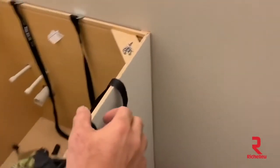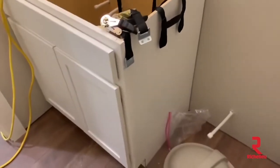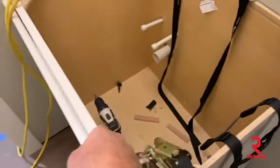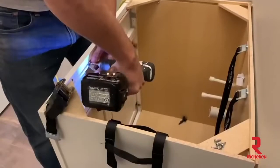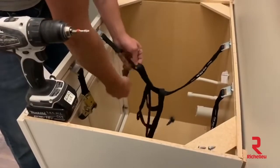So on a 3/8 side wall, we can't put a screw in the side because that's a finished end panel. So they screwed them front to back. You're going to screw it from here to there. So this install is slightly different. We're going front to back this time so the screws don't go through the finished end panel, and we'll attach it to the face frame on the front of the cabinets,